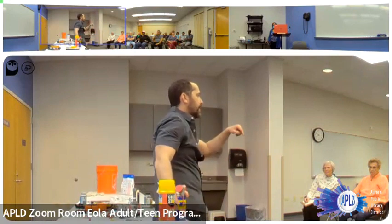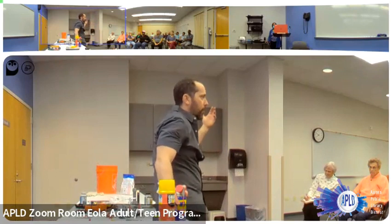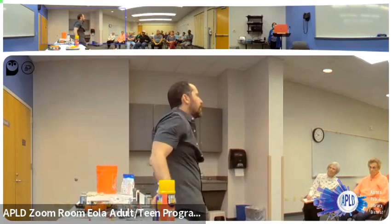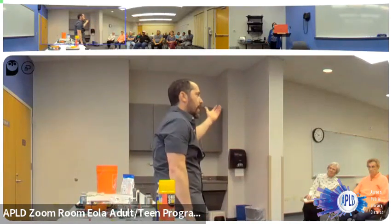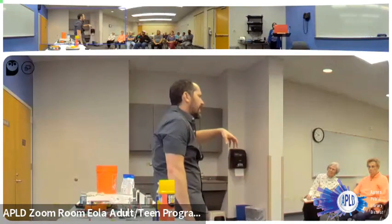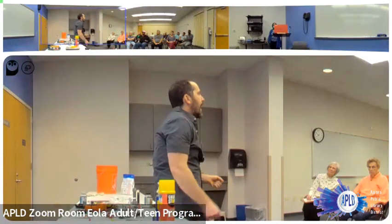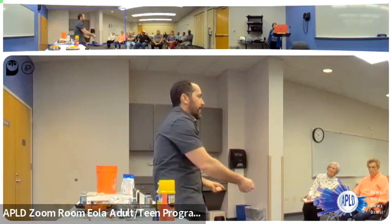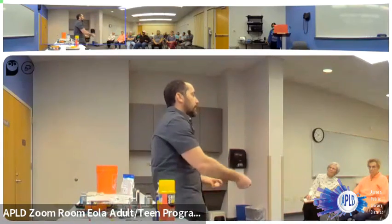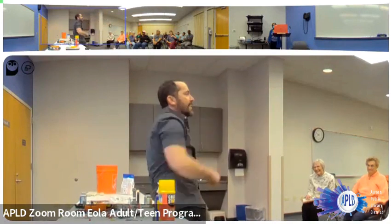One other thing, because it freezes here, I actually like to oil the rubber seal on the bottom of the garage door, and you can use anything. You can use old motor oil, or something like this. Because if that thing gets really wet, especially if there's a lot of leaves, it can freeze to the ground. And then when you push the button, the motor is totally strong enough to lift. And some of the safeties don't know to stop on the lift. They know to stop on the push, but not on the lift. So they will strip out this plastic gear, which is not that hard to replace and not very expensive.